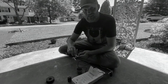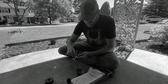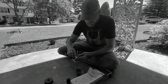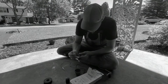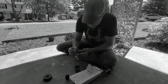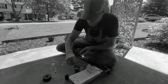This is a really cheap, easy system to do. As long as you keep it inside the lines, it won't make a mess on the outside of the blade — as long as the sticker is pressed down all the way. Every once in a while, when I think it's losing some juice, I'll use the other end of the Q-tip to clean up the area and get some of the blackness off, just to test how deep the etch is getting. Because the longer you hold it, the deeper the etch will be — so more is better.